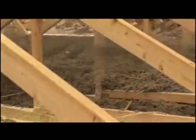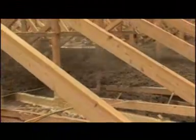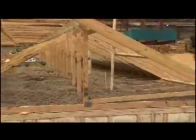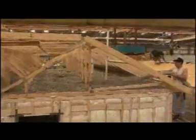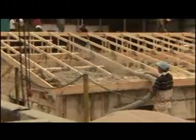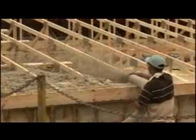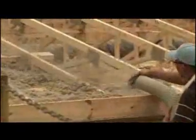Paper rulers are installed throughout the roof cavity to ensure the exact thickness of insulation is blown into the attic, to maintain an R30 or R38 insulation value. R30 is the standard roof insulation in an Oak Creek industrialized home. The Oak Creek home is constructed with a very tall heel area of the roof truss to allow for a more even distribution of insulation in the roof. Various climate conditions in the country require additional amounts of insulation to meet specific thermal conditions. The achieved R-value of the insulation is determined by a general average thickness across the roof surface.